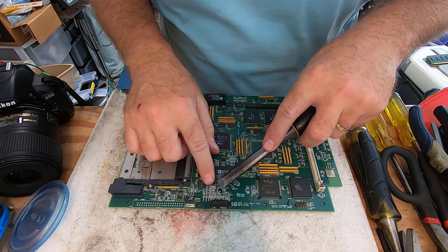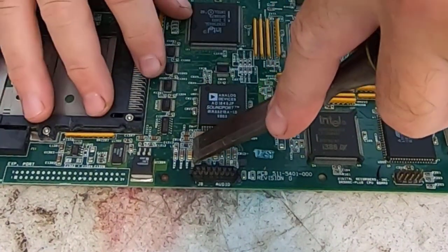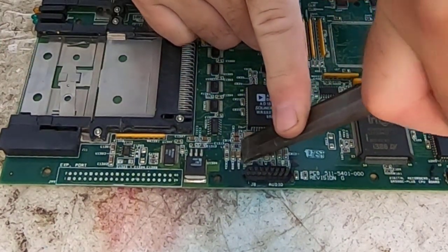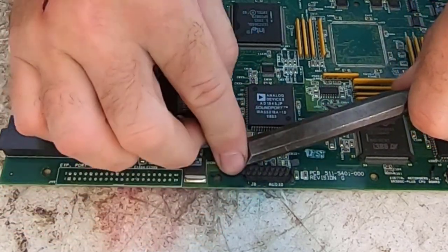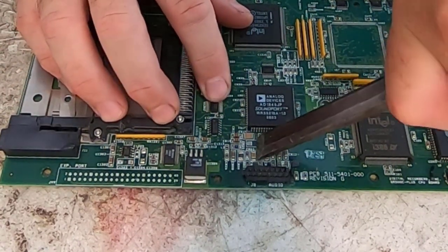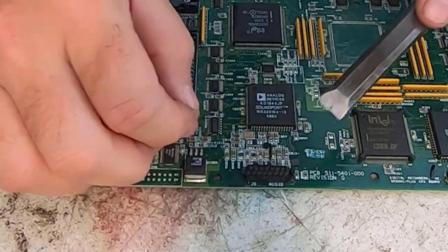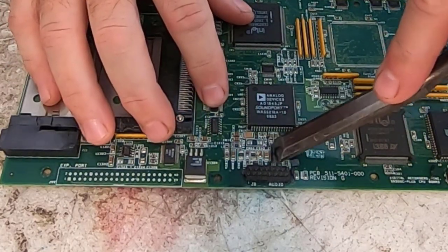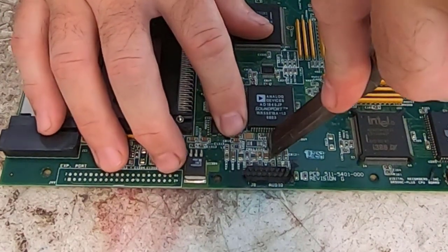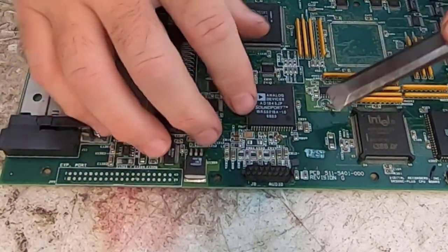All right, MLCCs right here. Again, you just take your chisel or a flathead screwdriver. And let me scoot it up here a little bit. So chisel, flathead screwdriver, give it a twist. MLCC comes loose. Some MLCCs are magnetic, some are not. The ones that are not magnetic most likely have a higher silver content, which is why they're not magnetic. And some people, as I mentioned in my depopulating video, separate their MLCCs by magnetic and non-magnetic.